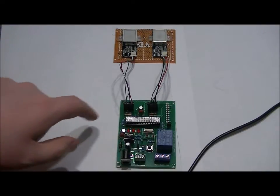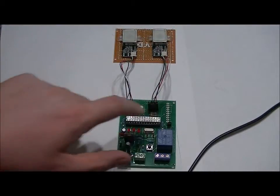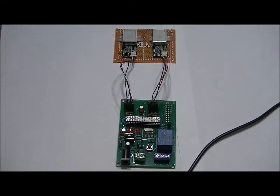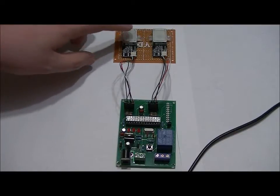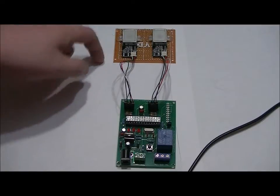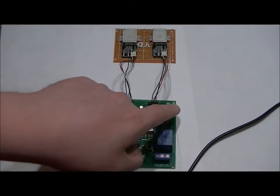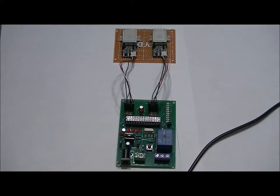You won't be able to see this added software function, but I've added in some options here so that you can easily interface with the port expander board. Now I'll get those printed circuit boards in soon, and I'll program it in an afternoon, and I'll show you a demonstration when I have that all in. But what that'll do is I've upgraded from 5 fingerprints per unit to 10 fingerprints, so any fingerprint coming off this, if it's a correct one, after every scan it will output that to the port expander, so you can control.